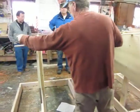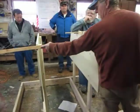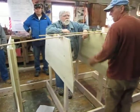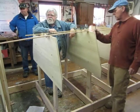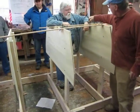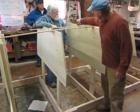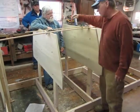We're going to have to do something for the transom here pretty quick, because we don't know where that's going to be. We're going to have to add at least a mock-up of the transom in there to do this. So anyways, once the notches are cut for the chine and for the keel, we're going to take a big Forstner bit — just a big round bit — basically.